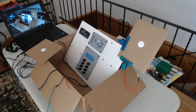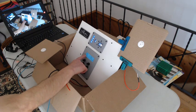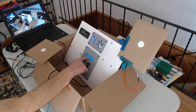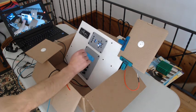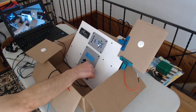It's hard to know. You're looking for ghosts and stuff and they disappear. Anyway, so what can we do about this? Well, one thing we can do would be switch the coils, and we can do this in software. So we go to the system page, and the PV is set to 0 now. We'll set it to 3, and what that does is swap the axes. We'll go back to the main page and do an ACAL.